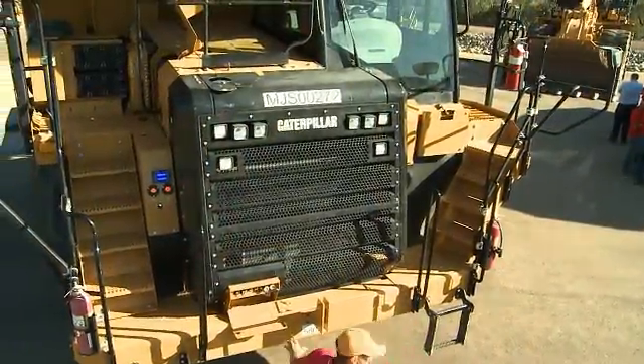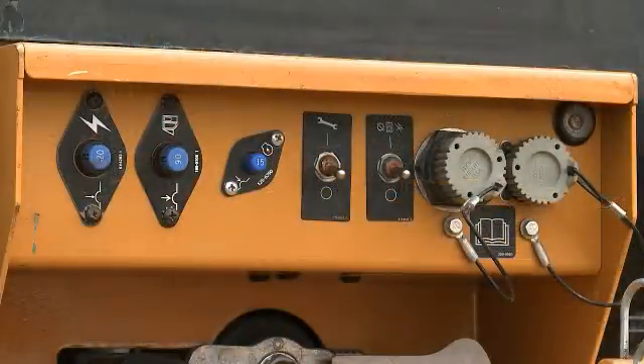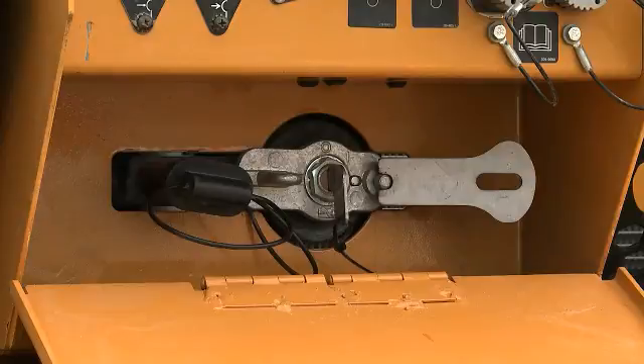We have a ground-level electrical box that provides access to the VIMS and the service ports. We have your safety switches for the crank and hydraulic lockouts. These also power the ECMs to perform your service and VIMS downloads. We also have your auxiliary start receptacle and your safety lockout/tagout, all at the ground level.